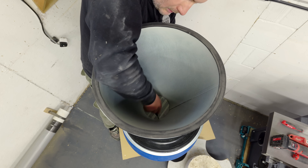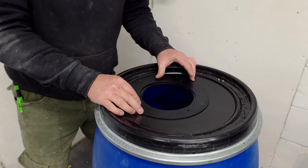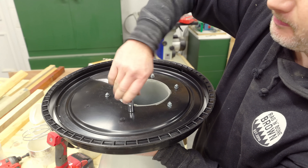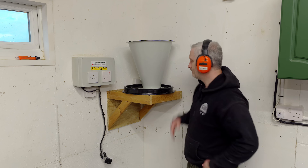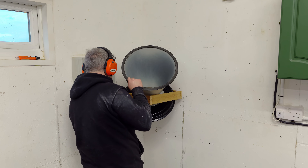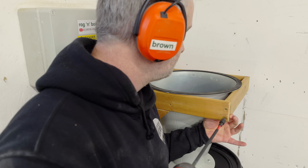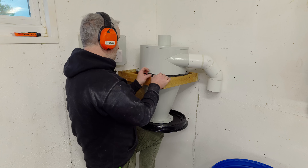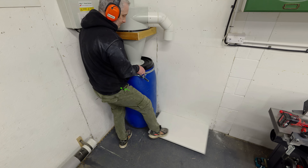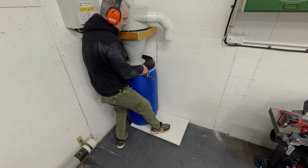That seems to work well so now I'll fit the cyclone onto my barrel. There's a rubber gasket provided that I can use to drill out the holes, and I use some M6 nuts, bolts and washers to secure it. Stupidly I then found out that I should have secured the lid of the barrel while the cyclone was suspended by my bracket as it no longer fits. But fortunately the glue hadn't dried yet so it's just a case of undoing a few screws and putting them in again. I can now get rid of my temporary spacer, and in future for emptying the barrel it's just a case of wheeling out the mobile base so that the barrel drops, and wheeling it back under once it's emptied.